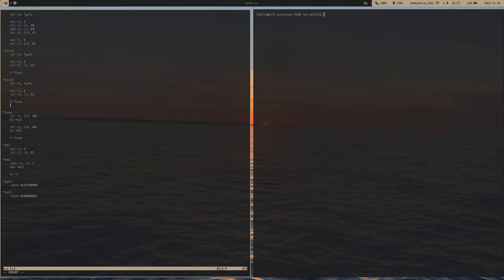And then we'll have to do this for all four cores. Jesus Christ. Let's see, core 1, let's say we're using pin 20. Core 2, we're using pin 16, and core 3, we're using pin 12. So now, whatever core function you start at, you load the GPIO into register 0, and then you load your bit number, your pin, in register 1, and then you jump to the loop and do this little blink on and off with whatever pin that core has.